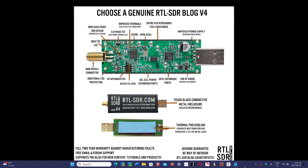If I had one thing that's a little more positive — since the V4 has an upconverter that is actually on the device — one of the major changes will come from the fact that on the V3, if you want to switch from HF listening to VHF, you have to go into software and move to the Q branch for shifting what you want to listen to. That also brings a lot of images. The V4 has changed that because of the upconverter, so I would expect better performance, especially regarding shortwave images. But for the rest, it's very similar to the original.